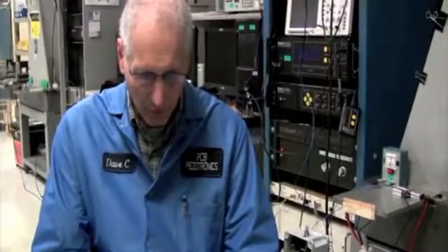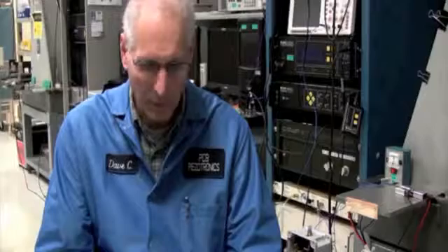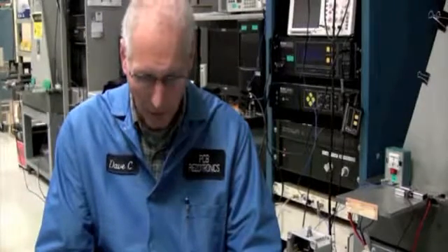Today we're going to compare the performance of three different types of vibration switches for sensing pure fan unbalance on large cooling tower fans. We will do this using a long stroke shaker to simulate fan movement at low frequencies and large displacements.